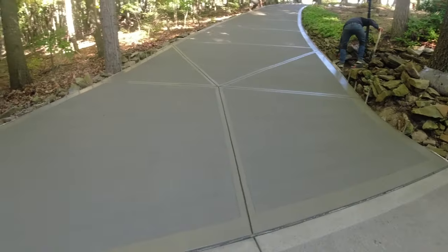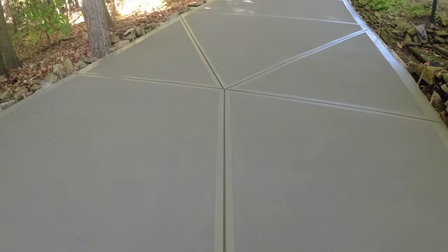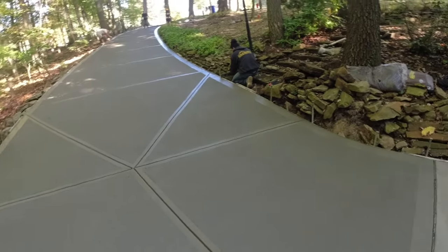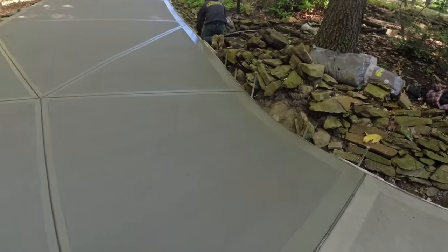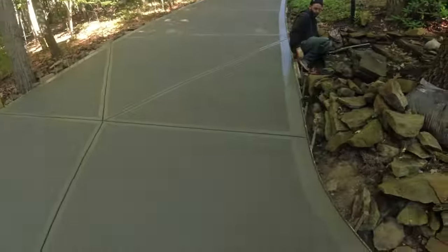Handful of tools. There is our finished design. So these cuts come off of the drain all the way to the edge. Center a drive up through. Now you can see how when that does crack, it'll follow that right off to the edge. And so it looks nice. We add a clip this way. So coming down the driveway, it just looks real nice. As well as this corner can flex a little bit and it'll send a fracture right through there.